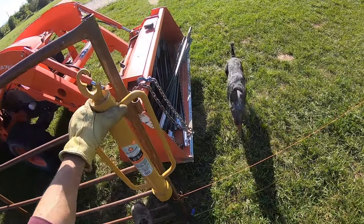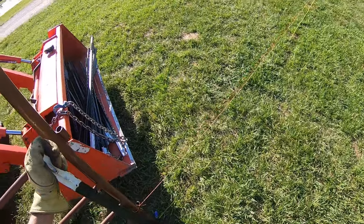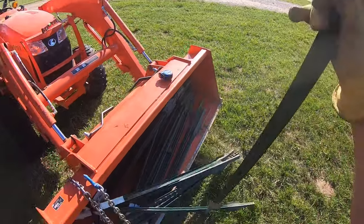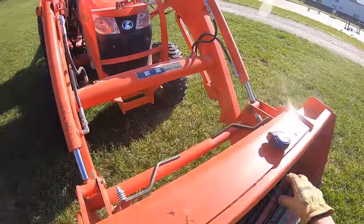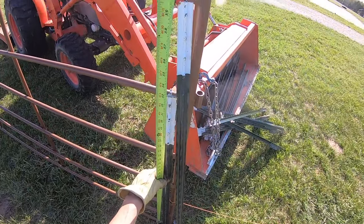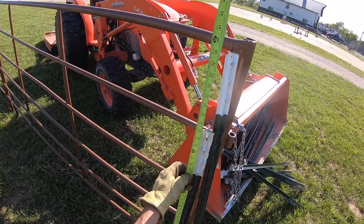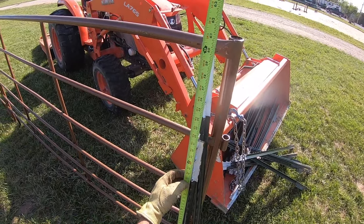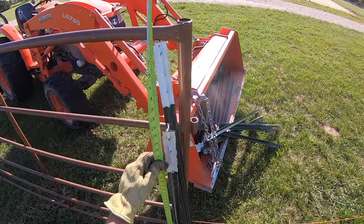Okay, so this was the 8-footer. The others are 5-footers. I'm gonna have about 45 inches exposed on these 5-footers, so I'm gonna make sure I'm at least 45. So 51, okay, that's fine for this first one. It gives me a little extra support here for this fence I'm gonna tie it to. And all the other T-posts will come at 45 across the top.